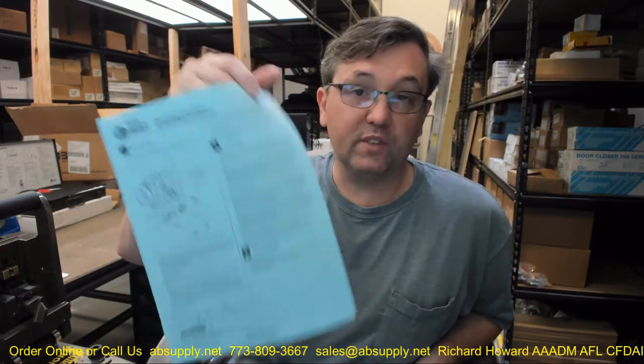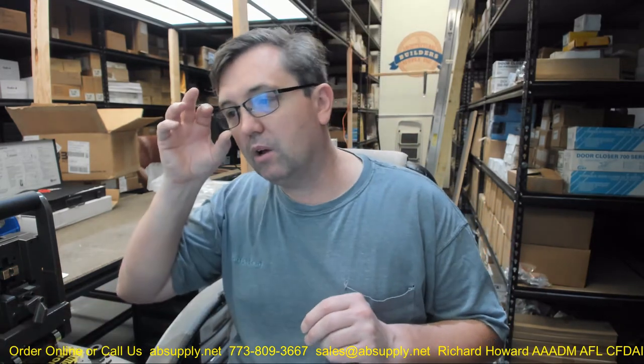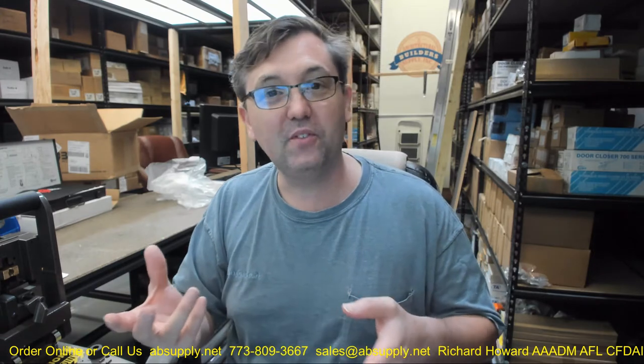The key carriage does not operate the way the installation instructions say it should when you're using a non-OEM blank — testament to how well engineered this is. It can even detect, for a manual machine, that you're using something that's not original. Use original key blanks and you'll have predictable operating experience. The service manual is an expanded version of the operating instructions with more language and larger images. I'd probably use the operating instructions first as a summary, cut a key, and then go to the service manual — which also shows how to remove the combinating dial and key carriage.